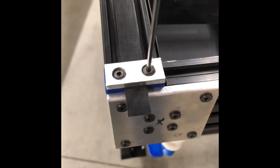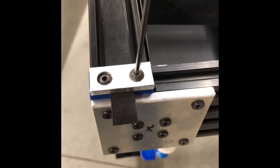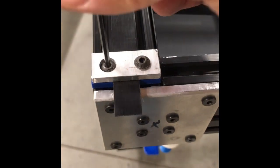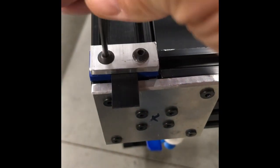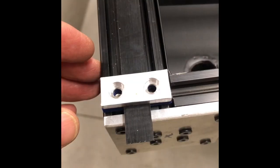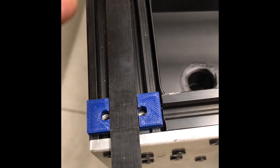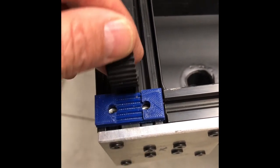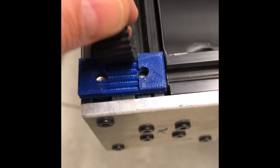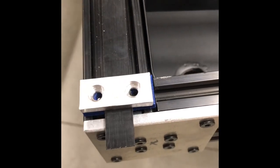The other place I used my 3D printer is for the brackets here to hold the belt. Now of course this top cap is aluminum, but let me take this off and show you the 3D printed part. I'll show you the underside of the belt — the teeth of the belt engage with the teeth that were 3D printed in that block. You just engage the teeth with the belt, put the cap back on, and screw it down tight.